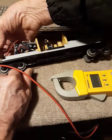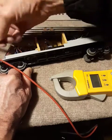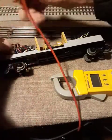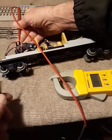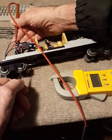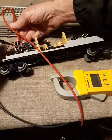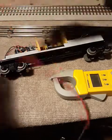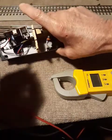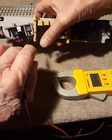That's the positive on the diode. Now on this capacitor there's no positive, and no positive on the voltage regulator either, so we know this point is positive. For the ground, it's going to go to the wheels — there it is. I get the ground on the capacitor right here where the little black line is — that's negative. Now we know this is the pickup side, testing to confirm this is the pickup side for the power on the track, which is constant power.